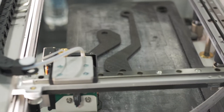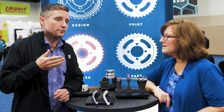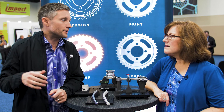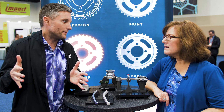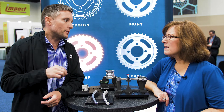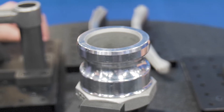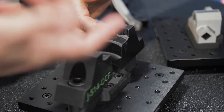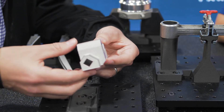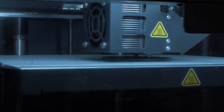Because it's built on the same chassis structure, and there are some changes that need to be made to the platform, we were able to reuse a lot of existing infrastructure. You get a machine that's a lot more affordable and a lot smaller in size, so the translation between machine size and build volume is much tighter and it fits in a lot more places. Most importantly, it's brought the cost of metal printing down to $125,000 for an end-to-end system that will get you a metal part — a dramatic improvement in accessibility. There are also nice benefits to the material type: because that metal powder is bound in plastic, it's safe to handle. You don't need hazmat suits; the protective equipment requirements and safety data sheets are a lot less demanding.